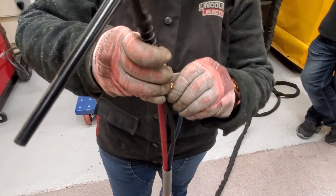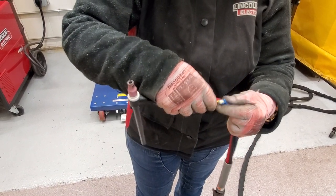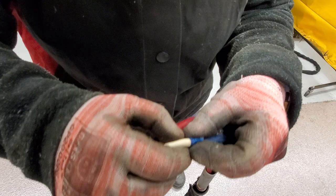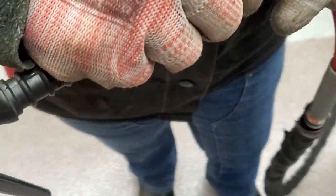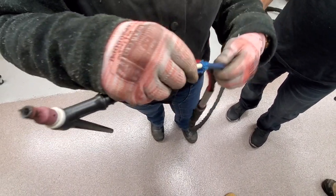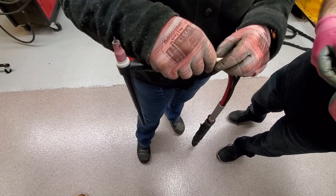Your goal is to open this up and look at the hose. The cut is right about there — see that little spot? It's a tiny little spot, just a little hole. This could be dry rot, which happens to hoses. Once we figure out what it is, we'll know the best approach. If it's dry rot we'll have to replace the hose entirely, but if it was just a localized issue like this we can at least repair it.